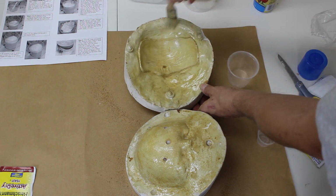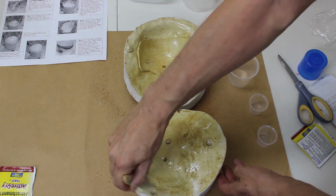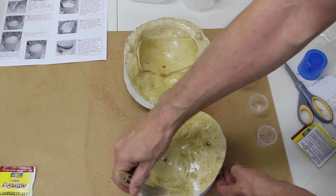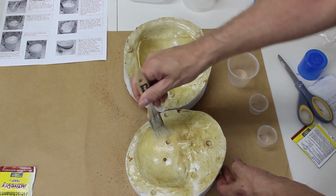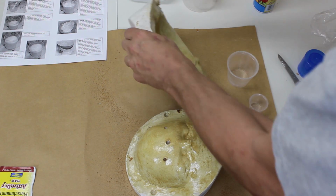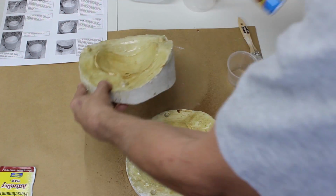We start by spraying both the positive and negative halves of the mold liberally with the cooking spray. Once the two halves are sprayed, brush the oil with an inexpensive chip brush to ensure the oil is incorporated into the mold surface. Don't worry about using your mold for something else later, as the vegetable oil is still compatible with most other casting materials. Be sure to remember to apply release to the outside of the mold, as the gelatin will probably run down the side of the mold as you close it.